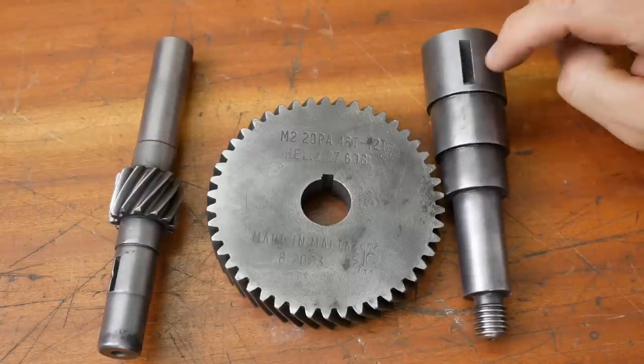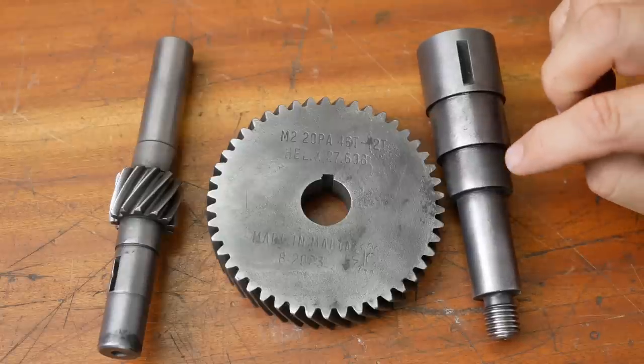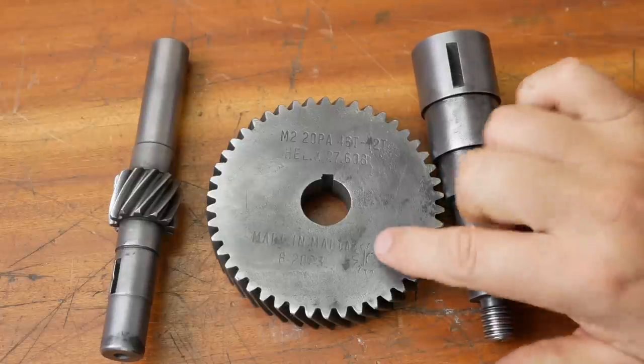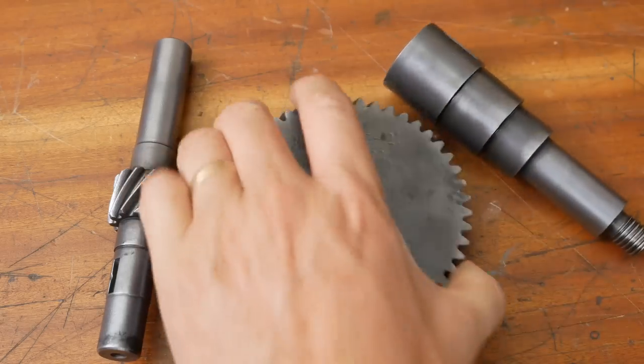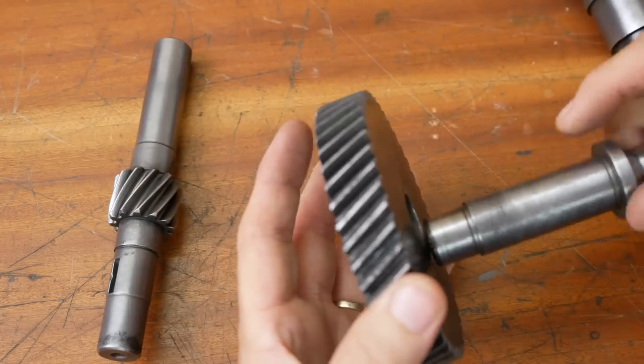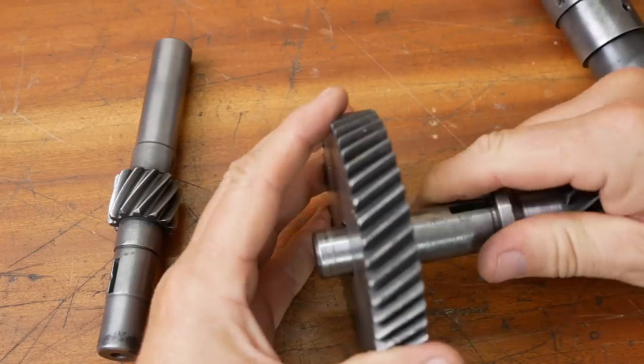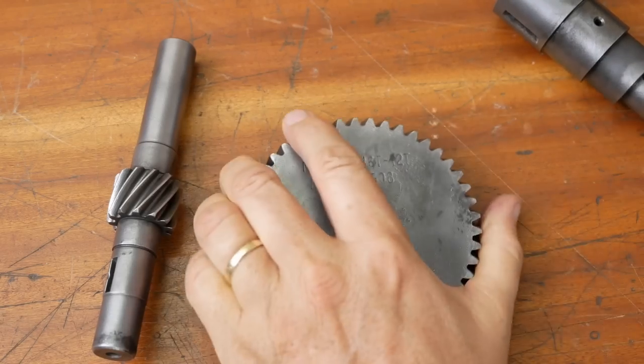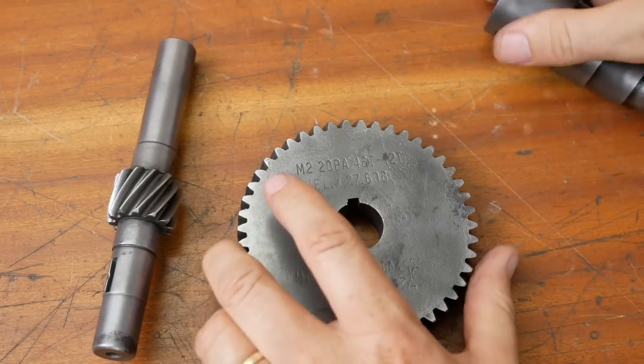Second, I should have left a final machining allowance on all of the bearing surfaces, with the danger of them going undersize. The gear itself, it's looking okay. Its bore is still a nice fit on its matching shaft. So I'm not too worried about it.